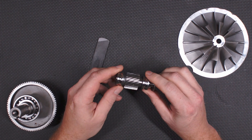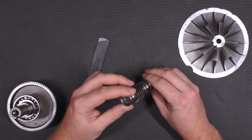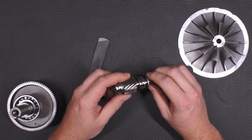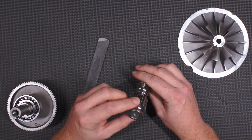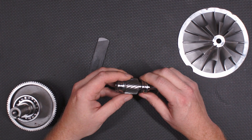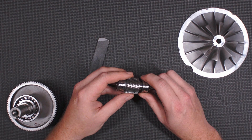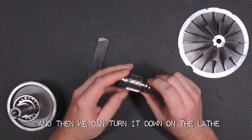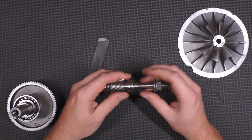I did find some other bearings that would work, but they cost about $150 a piece — I don't know if I'm willing to do that for this. It's a lot easier just to go ahead and make a little reservoir type of thing where you can swap out the oil, kind of like every positive displacement blower I've ever had. So I think we're just going to go that route. The way we're going to deal with the hardened surface of this shaft — because we do have to turn this down, we will have to drill a hole in the back — I'm going to have to grind this down. Hopefully the hardness is only, like beauty, skin deep. But we will find out for sure once we take a grinder to this thing. It's almost a shame to do it, but it has to be done.